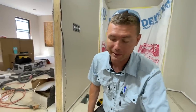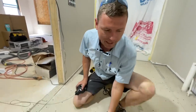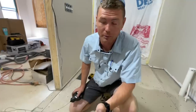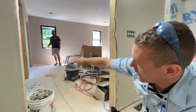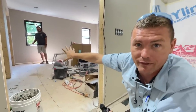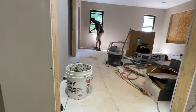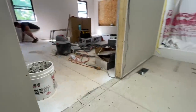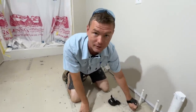It's time to do the tile layout in this room. I already decided where to place the tile, so I need some chalk lines to get my first rows straight. I'm not convinced the backerboard is installed perfectly square to the room, so I'm going to measure off my OSB line on the subfloor — I know it's the straightest reference I have. I'll pull that line all the way from down there and extend it into this room to get everything as square to the entire house as possible.